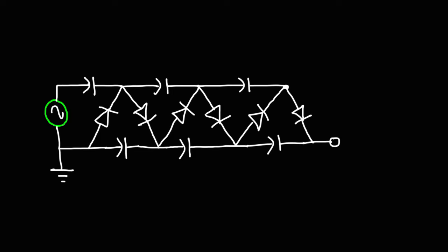In this video, we're going to talk about a voltage multiplier circuit — a circuit which you could extend as far as you want to increase the voltage of the input. We're going to use a 12-volt input. Each diode has a voltage drop: 0.6 for a silicon diode and 0.3 for a germanium diode. But let's ignore the voltage drop of the diodes, just to keep things simple.